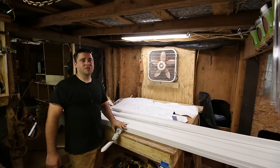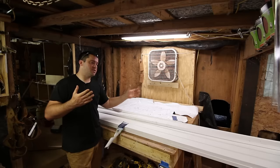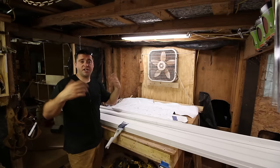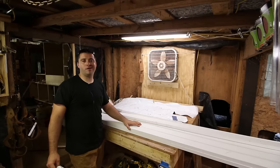So I'm going to be doing cedar shakes on the siding, and then I've got the mahogany windows, and I want a really rot resistant maintenance free house. Obviously I'll have to come back every year to 2 years and reapply a finish to the siding and to the windows, but that's something that I'll enjoy doing, so that's not a problem. But the trim, I don't want to paint trim every year. I don't want to put white paint on it, so I bought some PVC trim.